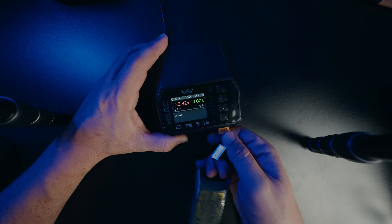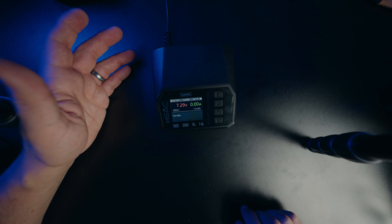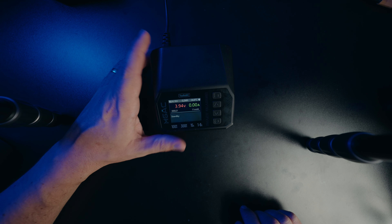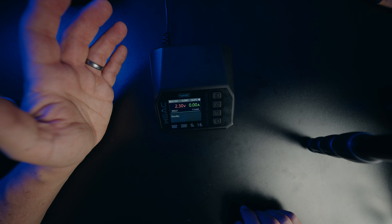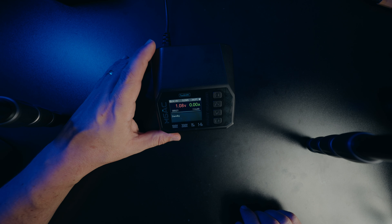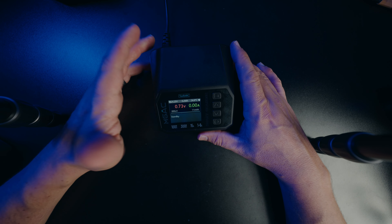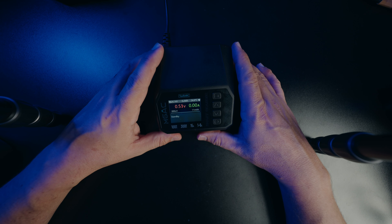It's 100 watts on AC — let's do the math. 100 watts on a 6S battery, basically 25 volts, so you're gonna be able to hit it with 4 amps. That's not a ton when we're talking about a parallel charging balance board. If I've got six batteries on the parallel, that's 1.3 times 6, so about 7.8 amps — we'd really be charging it at about half C for a full six-port parallel board. I would like to see more, but I'm not going to poo-poo it too much.